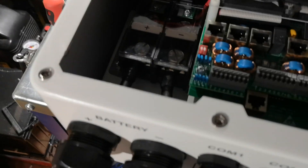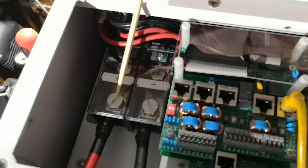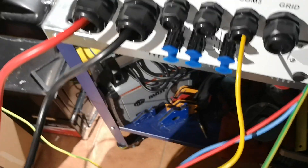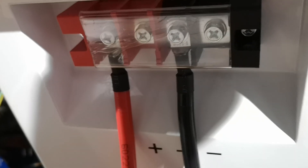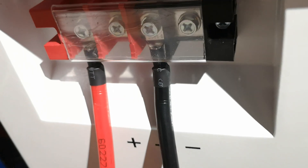For DC battery connections, we have pretty big terminals — M10 metric nuts. From the isolator we use M8. And from the BMS we use M6, which is pretty small. I think those bus bars are undersized for 200 amps, but that is only my personal opinion.